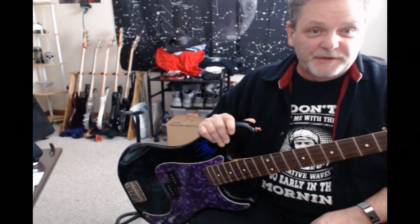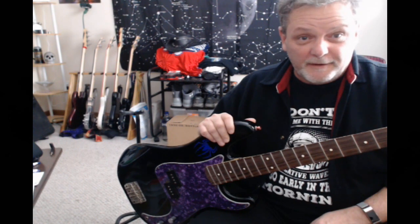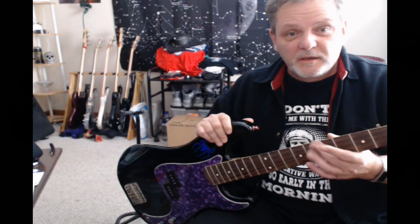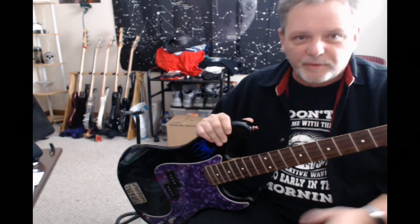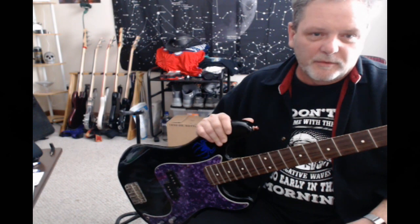What we're going to wind up with is a much more deep, growling, resonant sound out of this than I could get now. What's happening now is the A string pickup is just dead. And it's intermittent, which is even worse. While I'm playing it, it just drops out and creates a lot of headache for me.